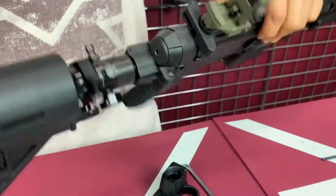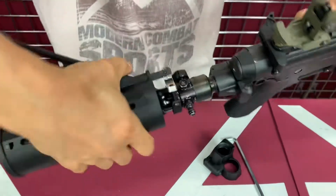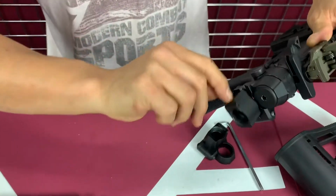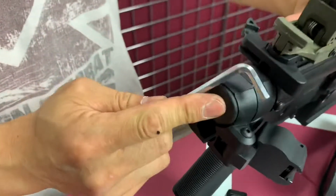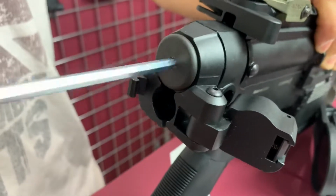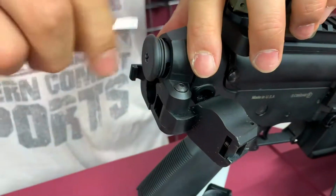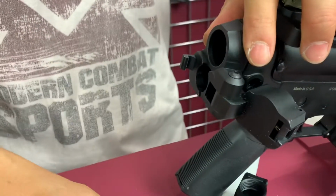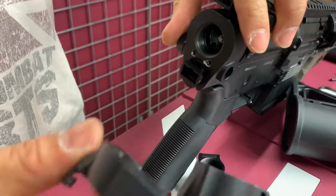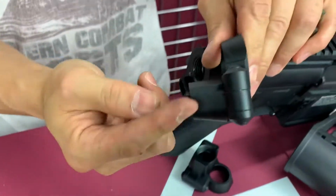Take your air tank off, of course. You see air just kind of coming out. And open and see this little hole nut right here. This is a 5/16 nut. Very gently take it out. Of course, each time you want to put a little oil in there to keep everything lubricated so the O-ring doesn't dry up, and you just pull it off. It's that easy. The whole unit right here is only about an inch, a little bit over an inch.